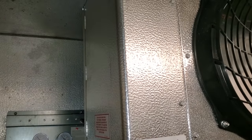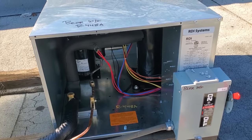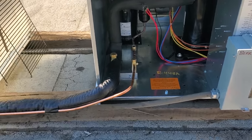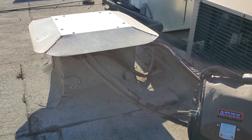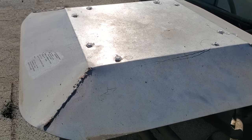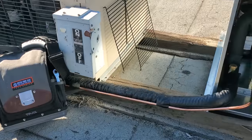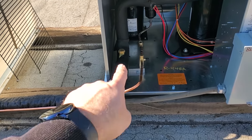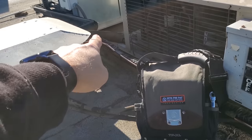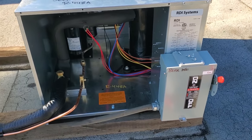We're going to open up the evaporator panels and check the evaporator superheat. Came up onto the roof, just waiting for the evaporator to turn back on. We're not always going to achieve perfect work — this works, it's fine, the line's supported. We sealed up the roof penetration — put a little dab of silicone and put the tech screws down to hold it nice and sturdy. The line set is a soft line set and we try to do one-piece line sets as much as possible.